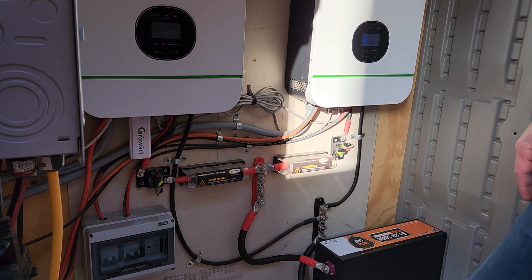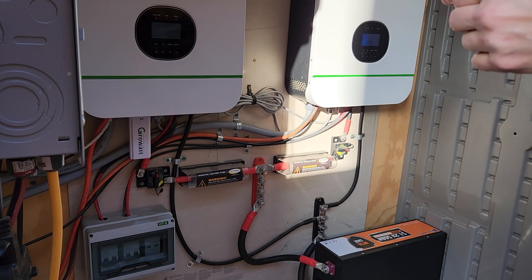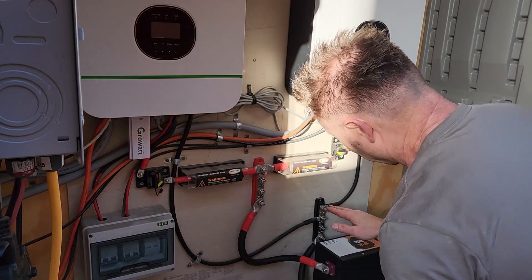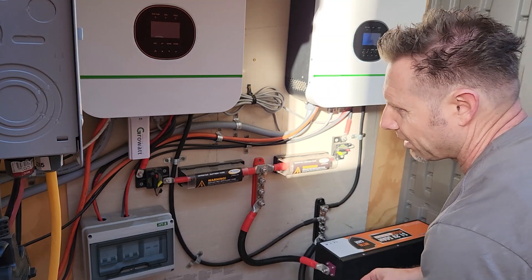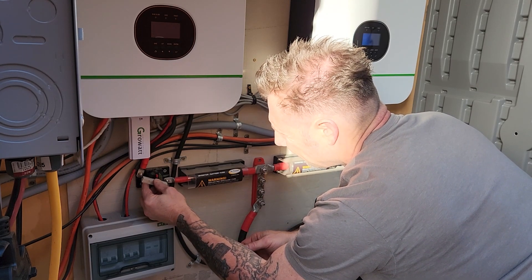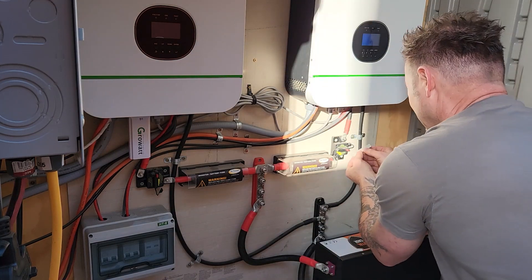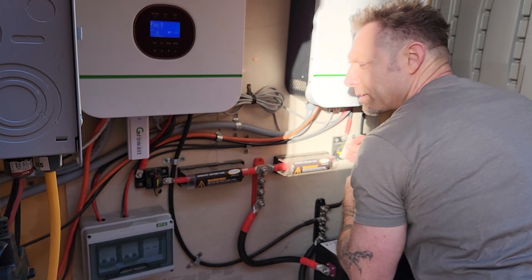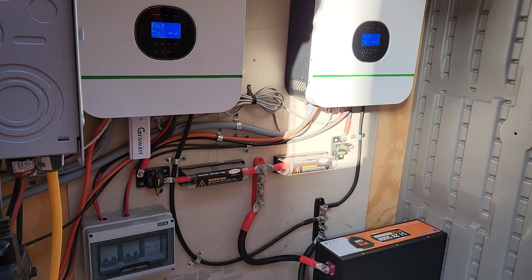The first thing you want to do is charge the capacitor in there. You charge the capacitor so you don't send a flurry of energy that damages your system. It doesn't always happen, but it can. We've got the battery hooked up - double check red to red, black to black, negative to negative, positive to positive. Everything else is already in place. I'm going to connect it - I just heard it come up - and then turn it on. I'm going to do the same thing over here: connect it, heard it, and turn it on. That's the safest way to turn your inverters on to make sure you don't cause too much energy flushing at once.